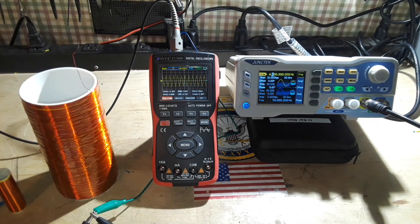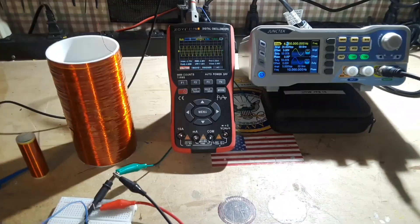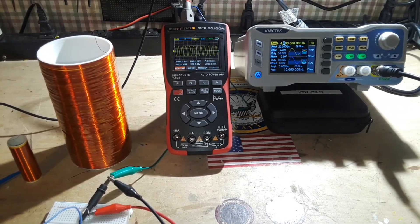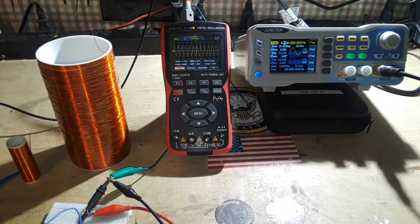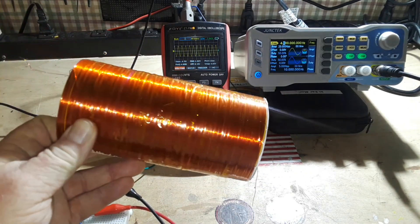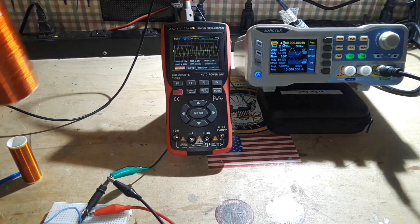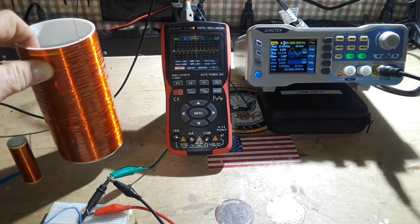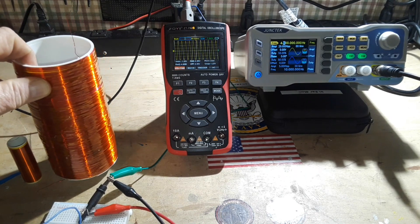Now that is surprising — those two coils are actually quite similar. So anyway, that is how you do it: measure the resonant frequency of a coil using an oscilloscope and a function generator. You're just looking for the low impedance point, because when the coil is resonant the impedance is zero and all you have is the DC resistance of the wire, which is almost nothing. Oh look at that — this coil is now affecting this coil. It's not affecting the frequency, but it is affecting the amplitude. RF black magic!